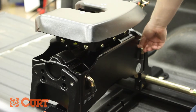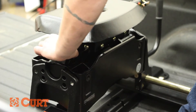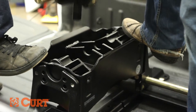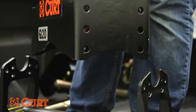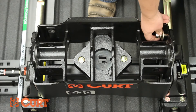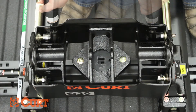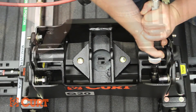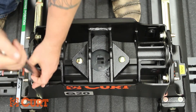Remove the head pins and clips as well as the bearing shaft caps. Have a friend help lift the assembly out of the body weldment and carefully set aside. Select the desired height using the adjustment holes on the sides of the Q20 main body weldment. Secure the Q20 main body to the R20 using the supplied 14 millimeter bolts, washers, and lock washers. Finger tighten the hardware and then use a ratchet or wrench to fasten the hardware down. Torque all hardware to that specified in the supplied instruction sheets.